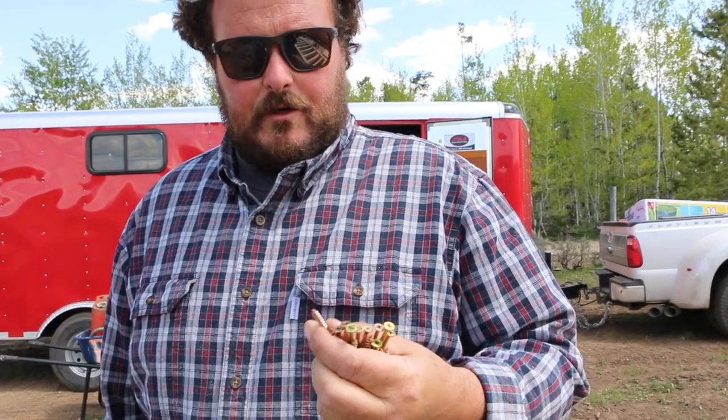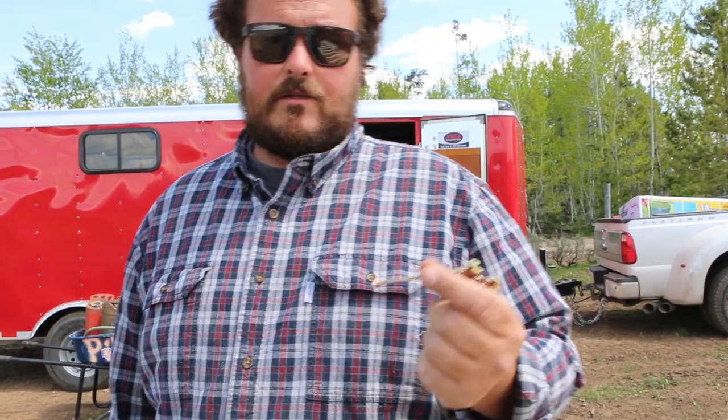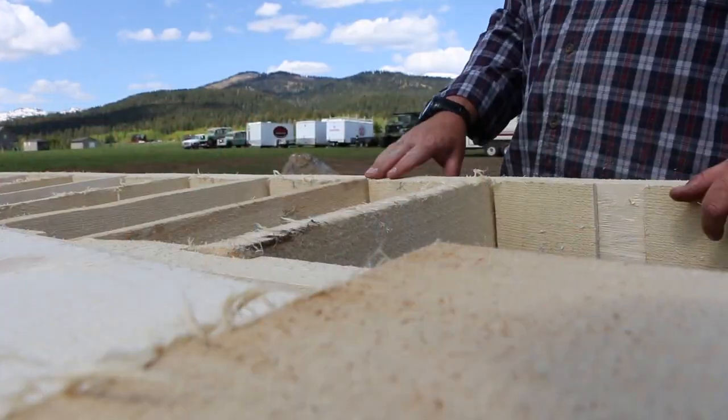Using 3-inch grabber screws, and I really like these. You can get them in all sorts of different coatings for interior, exterior use. They're relatively inexpensive and they're great fasteners. My only concern with them is sometimes you can break the heads off. They don't have great shaft strength. But put in 3 or 4, and if you need to take it back apart later, make adjustments, change something, the 3-inch grabber screw is a great, great fastener to use.